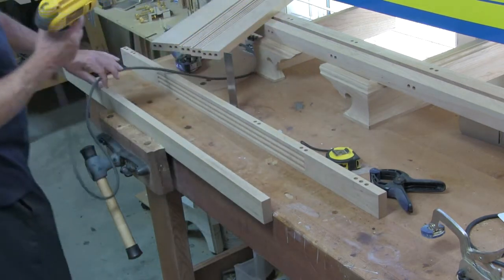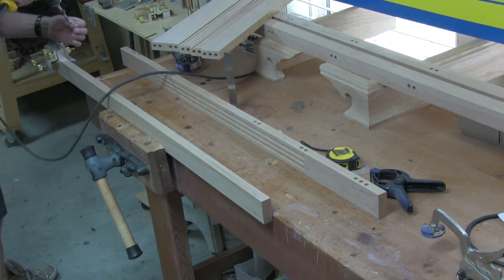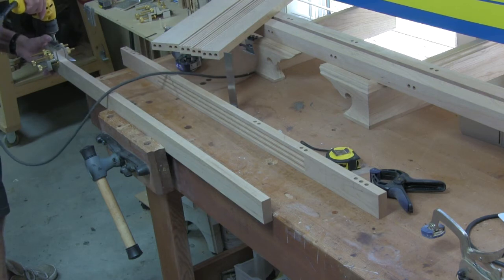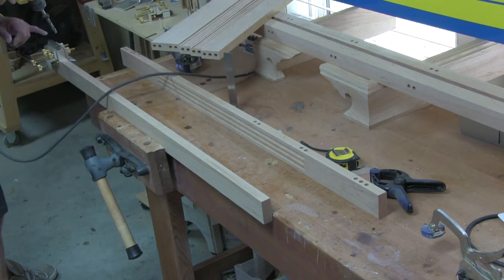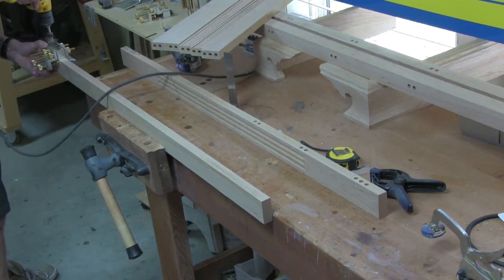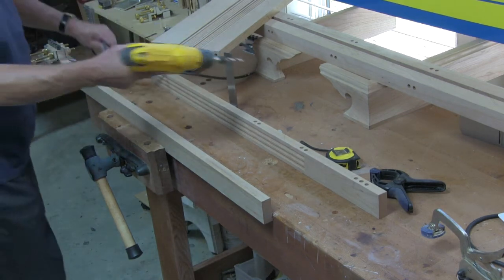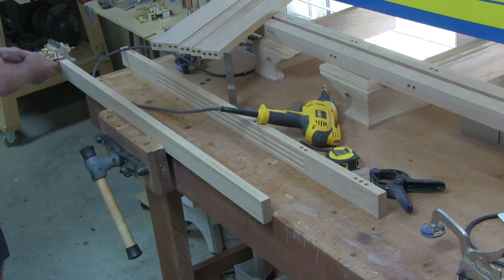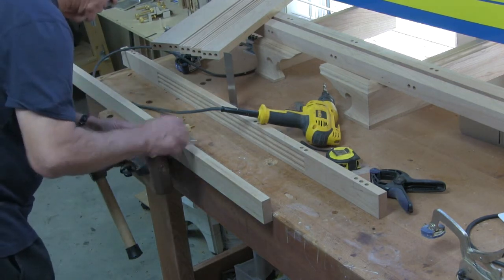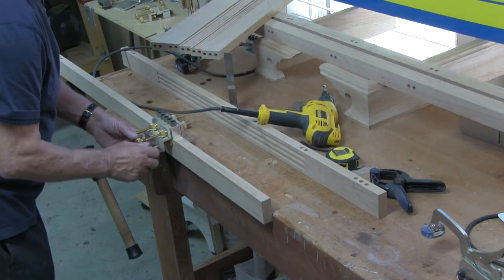Now, we're going to be doing 4 here. Always stop it before you go into the guide, because if you don't, you can damage the cutting edge of the drill. So in this case, we're doing 1, 2, 4, and 5. Now, that's the top one done. We've come down to our line — it's a very fine line, so we just want it showing no more. So it'll be exactly the same as the other one. That's perfect.